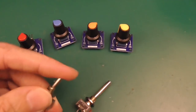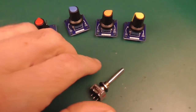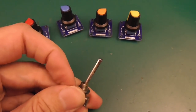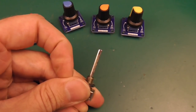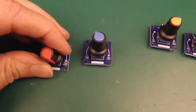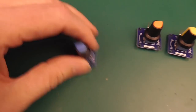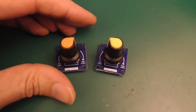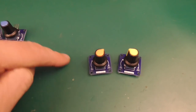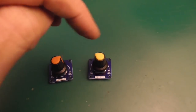The way I want to control this machine: a two-position switch decides drilling or tapping mode. A three-position switch controls direction — one way advances into the material, the other retracts, and the middle does nothing. Two dials control speed: one for drilling speed, which will probably be full speed, and one for tapping speed, which will be about one-third speed. When tapping, I want it to automatically go in for two or three revolutions and then back off by half a revolution. One dial sets the total cycle duration and the other sets the percentage of time spent going forward versus backwards — probably around ten to fifteen percent in reverse.